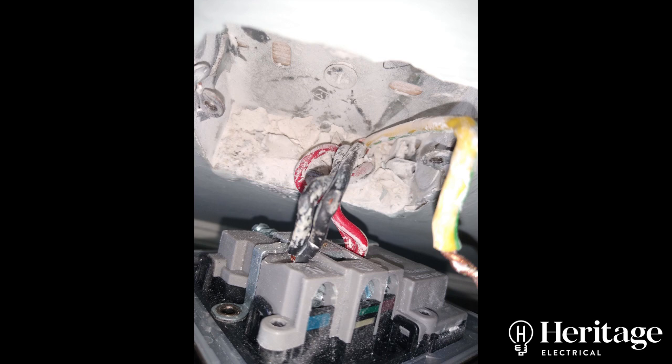The customer replaced these socket fronts from PVC to metal, and this is a problem for a couple of reasons. With only MCB protection previously, if there's a fault to the metal socket the fault current is going to be higher than with RCDs, presenting a higher risk. Combine that with the screw terminals not being tight enough and, as we've seen, changing the socket fronts has introduced a fault into the wiring. The moral of the story is that even for something as simple as changing socket fronts, light switches, or light fittings, you're better off getting a qualified electrician to do a proper job and give you the correct paperwork, rather than attempting it yourself — what might seem a simple job has inherent risks and can lead to dangerous situations in your home.